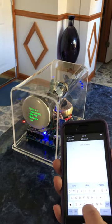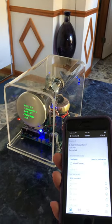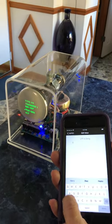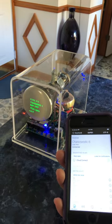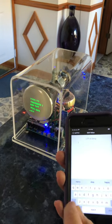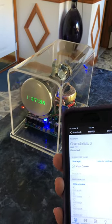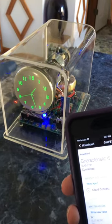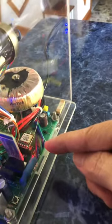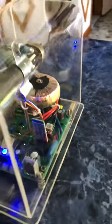The options are Wi-Fi, off — if for some reason you want to set the time yourself you can do that — or GPS. I'm going to set it to GPS, then select the next line, and exit the menu by typing capital A, which takes it back to the run screen. Now it should be extracting time from the GPS module. The GPS module will blink about once per second when it has a strong lock on a satellite.